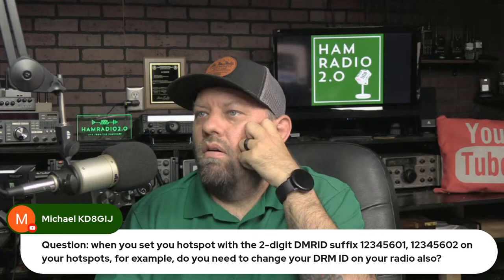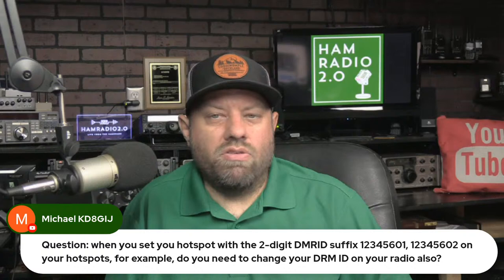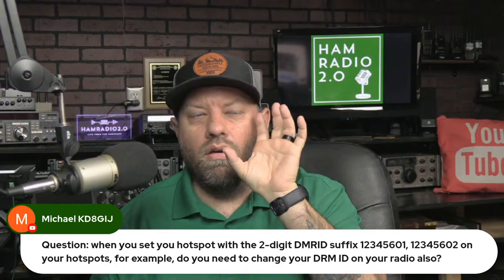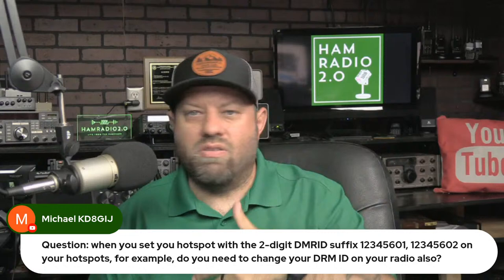Michael, when you set the hotspot with the 2-digit DMR ID suffix, do you need to change your DMR ID on the radio also? No, you don't. Think of a hotspot like a repeater. If I put up a repeater under my call sign and my ID, you can key it up, and 100 other people in the area can key it up also with your radio, which has your subscriber ID in it. It doesn't matter. The ID of the repeater and the hotspot is how that hotspot identifies on the network. It doesn't matter who keys it up after that. So no, you don't have to change anything on your code plug, on your radio, nothing like that.